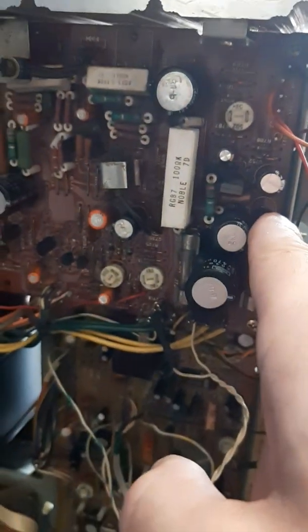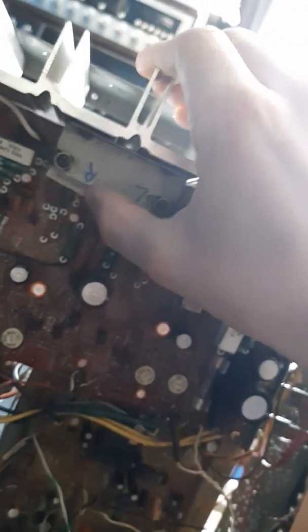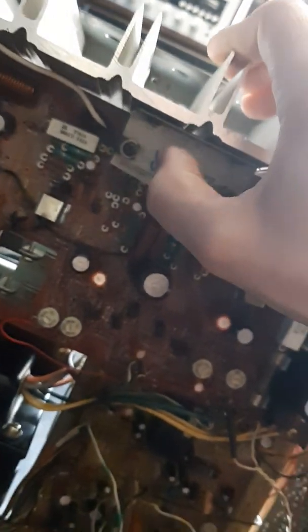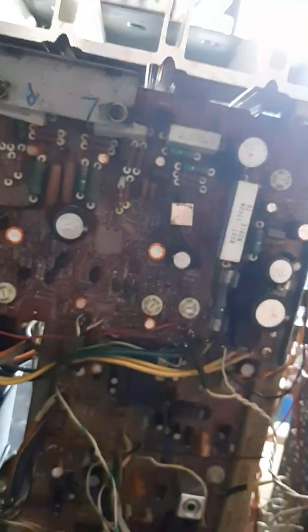I know that these three capacitors were changed, but I didn't see any other ones marked in the technical invoice from the last repair shop. I noticed these aren't the right screws — they're not making perfect contact here. Sometimes these components have to be grounded, but I think in this case they should just be diodes with both connections present, flush against the heat sink to dissipate heat properly and to match the temperature of the output transistors.